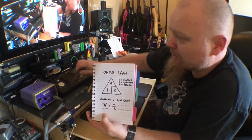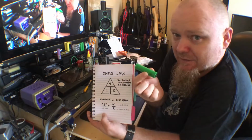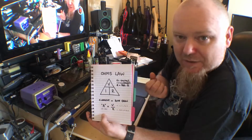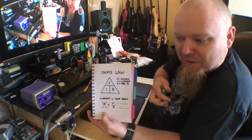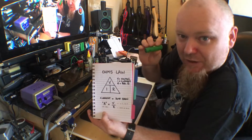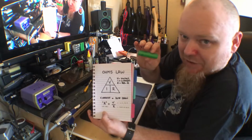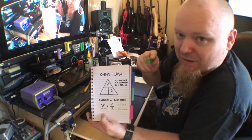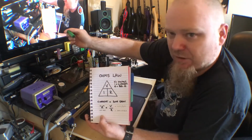These batteries we use for vaping, these 18650s, are not really intended for use like this. They're supposed to be in safety protected battery packs, like if you've got a wireless vacuum cleaner, the dustbuster things that you plug into charge, they'd usually have 7 or 8 of these in a sealed battery pack with a circuit protecting it from overcharge and things like that. So these can be a lot more dangerous than your TV remote batteries. They hold a lot of power and can be dangerous. So for your safety and for those around you, you need to be aware of this. It's not to put you off, it's just you do need to know about it.